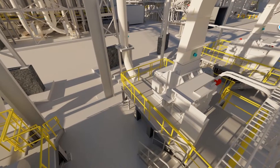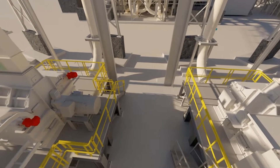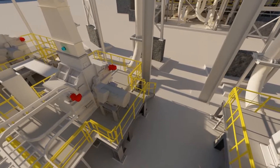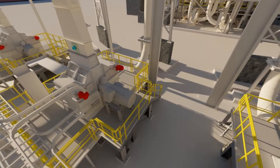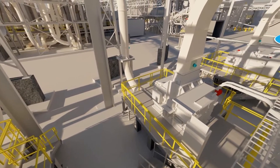After the choppers we have a total of four hammer mills to further reduce the size of our straw. After these hammer mills the straw has a size of approximately two to three centimeters in length, which is the perfect size to refine them in the subsequent refining section.